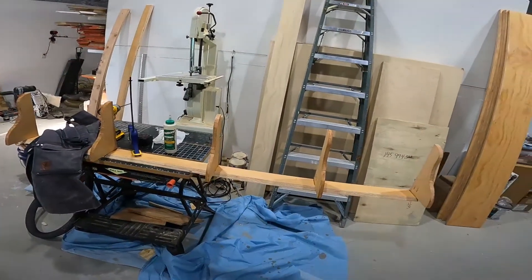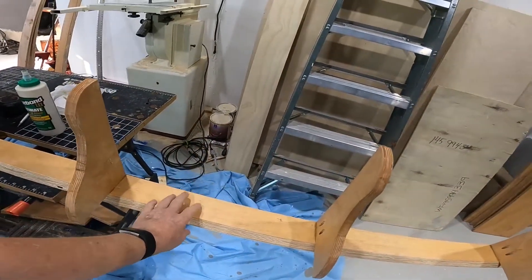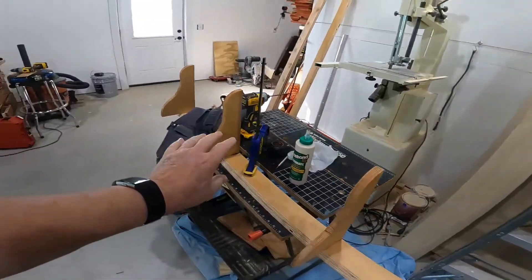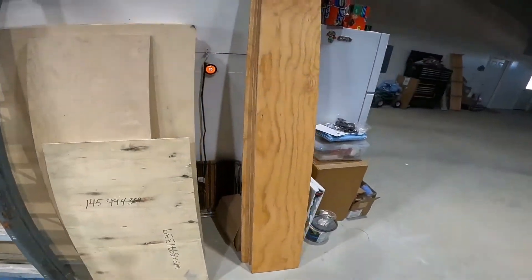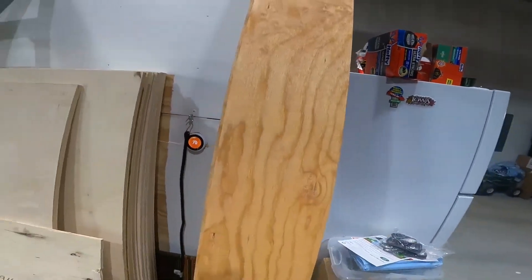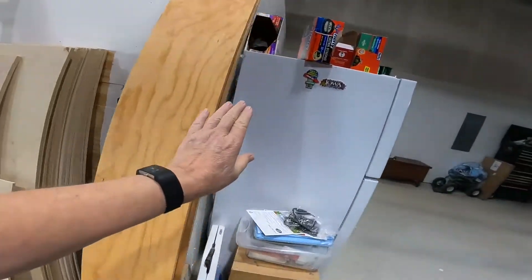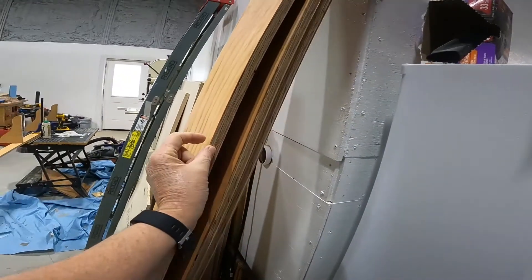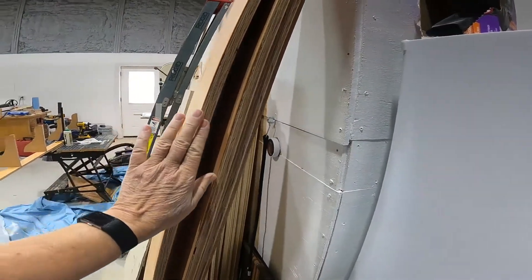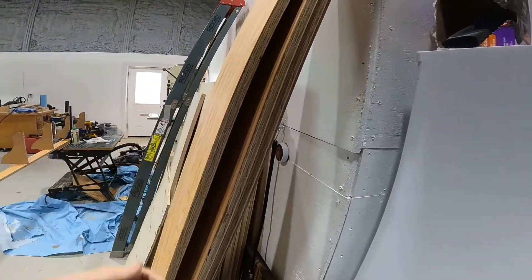Now I'm working on the pantry shelves. Here's the French cleat that goes on the wall, and here are the outriggers that go on it, and then here's the actual shelf that will be put on once I install that. I've also got to cut some additional oak to wrap the shelf on the front. It'll have about a quarter-inch lip so stuff won't fall off the edge — a nice piece of oak sticking up about three-eighths of an inch so cans won't fall off.